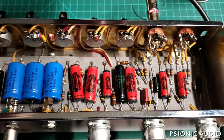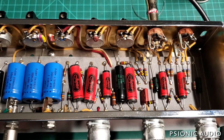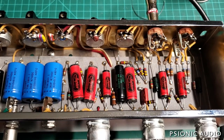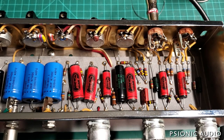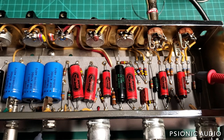I have changed that tube and there's no difference — it made no difference. So it's not the tube. It is either a faulty 820-ohm resistor on the cathode, or DC leakage on the board. And I can confirm it is, in fact, leakage on the board.